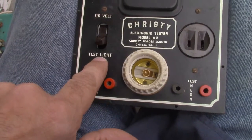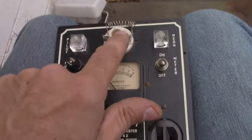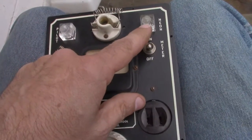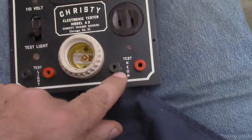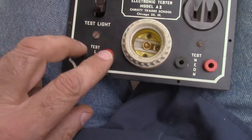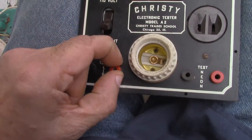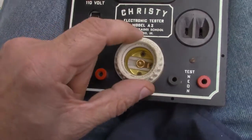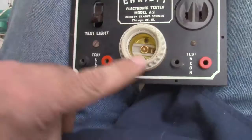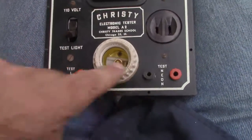I believe this either used the test lamp or went through this socket - this is a shunt. This might have been an indicator light. But basically, in a nutshell, you had mains power on these probes out in the open with no safety really, and you were going to get your butt kicked if you got across it the wrong way. The way I use dim bulb testers is just that - you plug them in, put a bulb in here, and use the socket. I never use these probes.